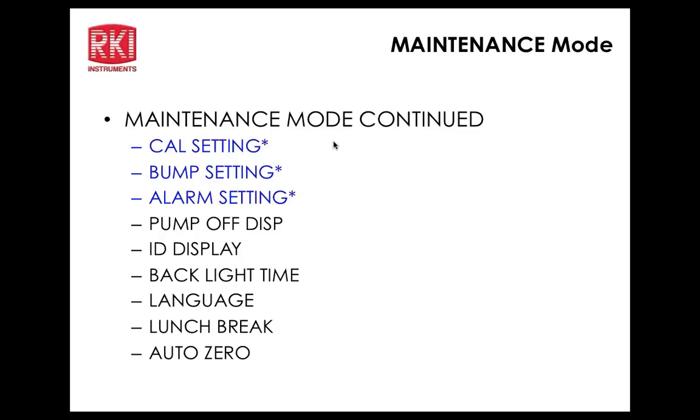So you turn the pump off and it's a diffusion instrument. No, it's not functioning if you turn the pump off. Right. That's only there to allow somebody to save power when they're not actually using the instrument, but they don't want to turn it off. Does the screen go blank, or does it indicate that it's not monitoring? Yeah, it does give you a message on the screen. Do we know anyone that actually uses that? Never heard of it. I think in the bar hole mode some people might want to use that, because they only are taking a test when they've got the thing down the bar hole, but they don't want to turn it off in between. I don't know why anybody else would. I think somebody else asked. Wasn't it one of the other international companies that asked for that? Somebody did. We didn't actually ask for that feature, but it was put in because someone else asked for it.